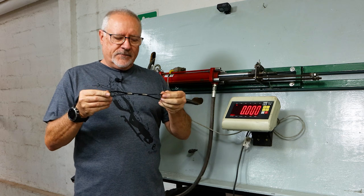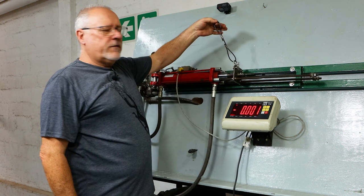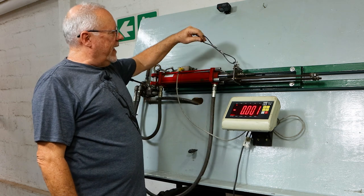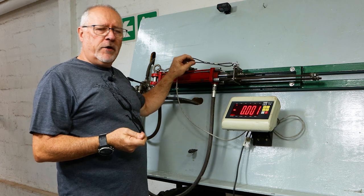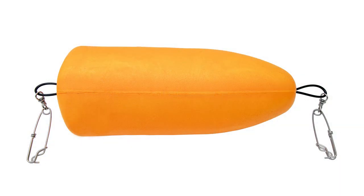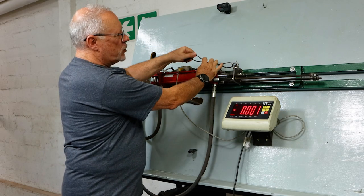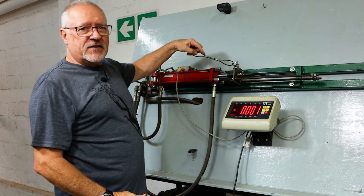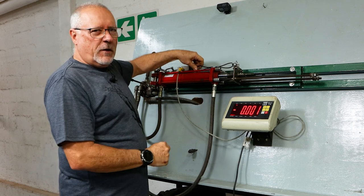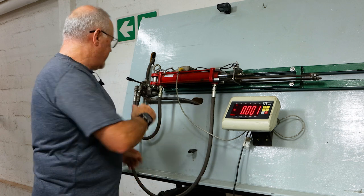I'm just for interest going to break this 4mm mono now. This mono is the 4mm mono we use inside a small foam blown float — we have a way of crimping it so the crimp ends up internally and you don't even see it. The main reason is to support it on an insert that protects this zone. Now we're just going to break it and see how high the pressure goes.